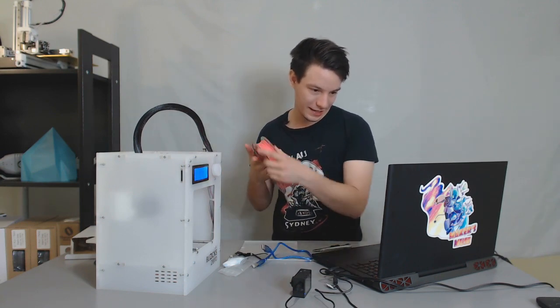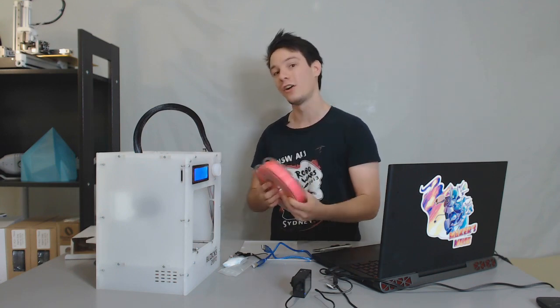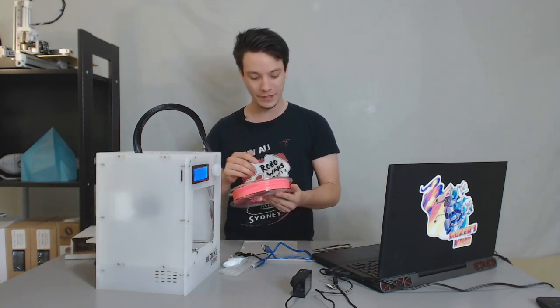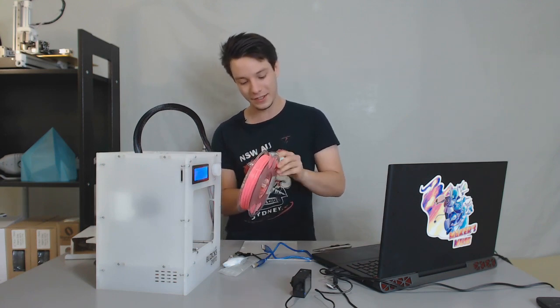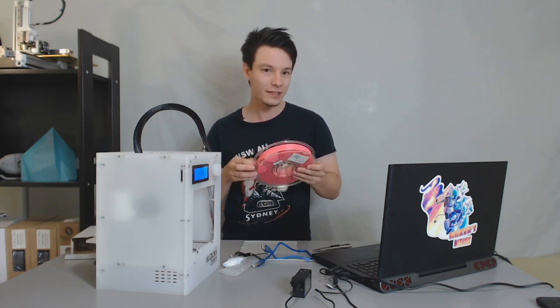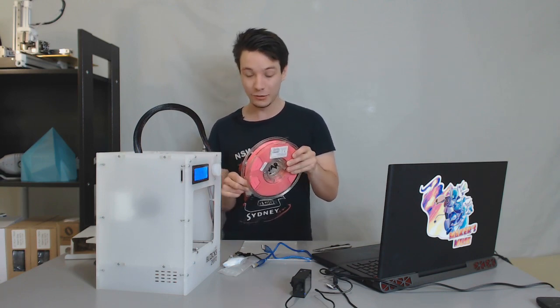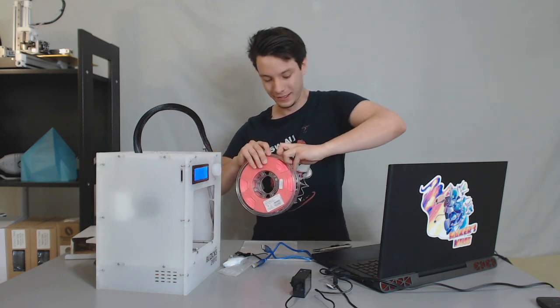3D printing science is saying if I wanted a very high quality printer, would you make the plate move or only the hot end? I would make only the hot end move. If you have a plate moving, you have a much larger mass and it's harder to keep it accurate. That's why I like H-bot style configurations, and also a good delta can print really accurately and quickly. I prefer if the plate just drops down on the Z axis rather than moves around.